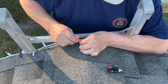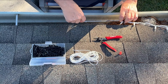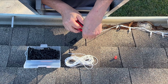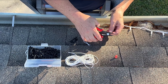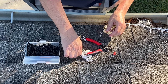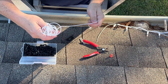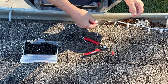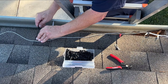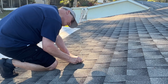This isn't a permanent installation; a permanent install would have had much more weatherproofing to withstand the heat, rain, and wind here in the Tampa Bay area. Now we go to the back side of the house, where I have the right leg of the dipole. There's the loop — it's just connected to a connector holding it to the shingles. I take off that loop, strip it down, and then take my extra length of wire, strip off the end, and join it to the right leg of my dipole with a wire nut. Then I get that final length of wire tied down and clipped to the shingles.